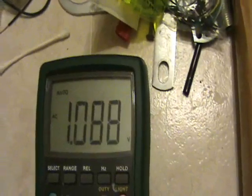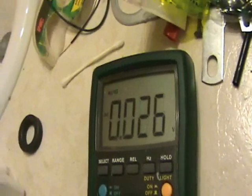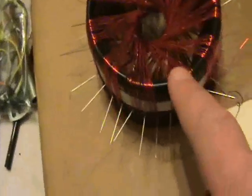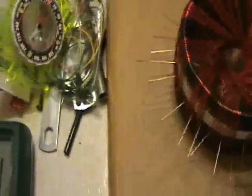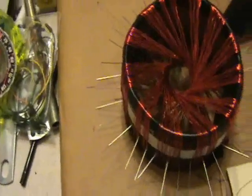Anyway, flip this on and you can see there's like 1.1-ish volts peak to peak. The interesting thing is I can switch this off and you can see it kind of spins down. So the magnetic field is still spinning there for a little while in the metal — the coil is still picking up energy as it spins down. There's no power applied. So bottom line is with metal here, the spin induced continues for quite a while. We're basically altering the time constant. It's like a flywheel that gets spun up, and even if you kill the power, it still keeps going. I have more experimenting to do, but this is tonight's findings. Thanks.